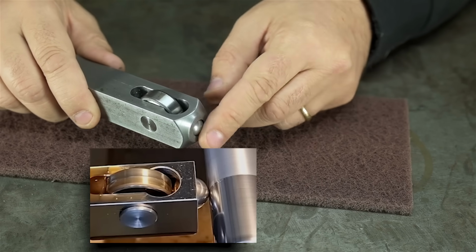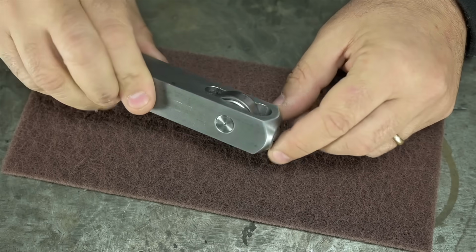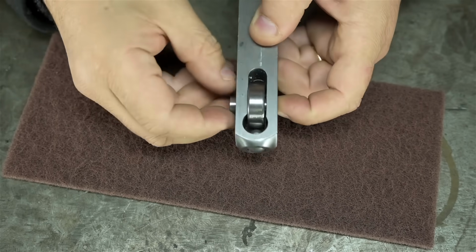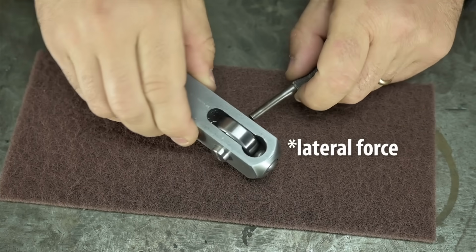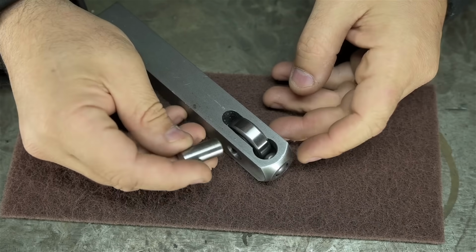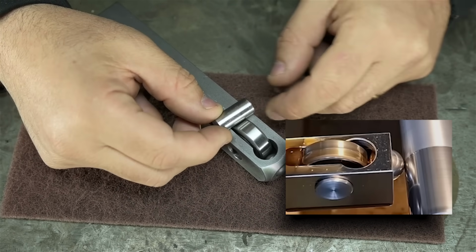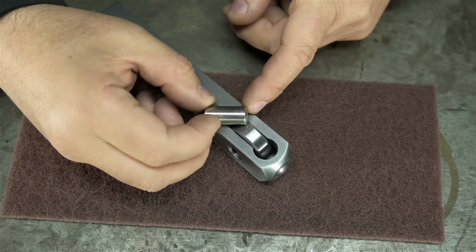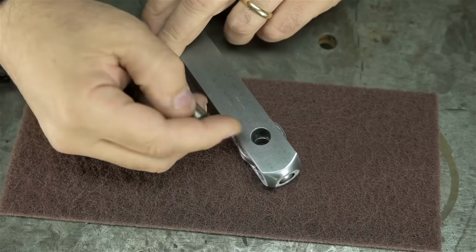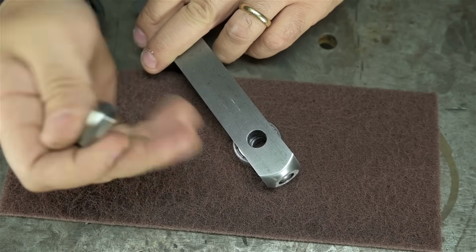His was sticking out a little bit more, but I don't know, maybe it's colder in my garage. The eagle-eyed among you may have noticed that there's nothing holding this pin in. To be honest, there's probably not a ton of force on this, but we should probably find a way to retain this. We've got a lot of options. In the video, that looked like maybe a headed pin, and on the other side, a push nut or a circlip or, I don't know, a spot of weld or something. Loctite might also do this, or frankly, just a half-inch bolt through this thing with a nut on the other side. Wouldn't look super professional, but I bet it would work.